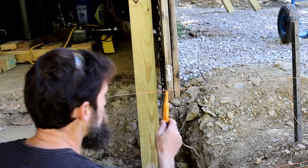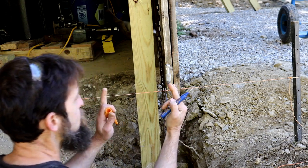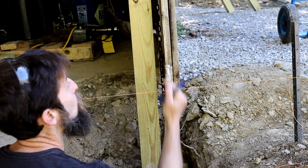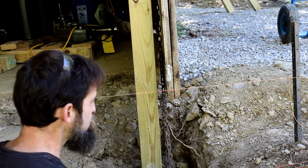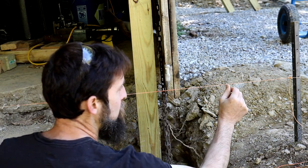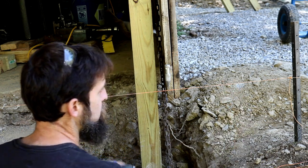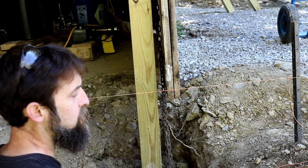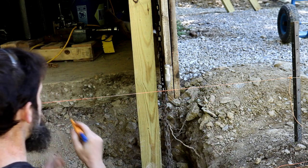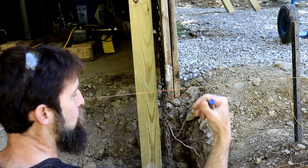So where my plumb bob rests on this line, I've made a mark, and this represents the outside edge of my block that will run up to the header beam and form the wall that's going to be the front of the shop. So I did the math, made the mark that represents the outside edge of my foundation. From that mark, pulled 24 inches because that's the width of my footer. Made a mark on the string over here, and I'll pull 2 strings from this back to my other posts,